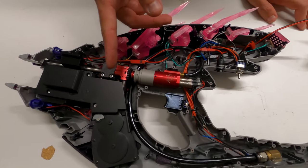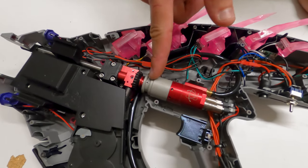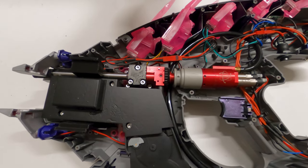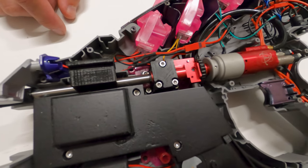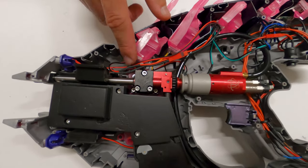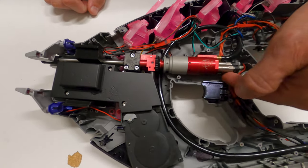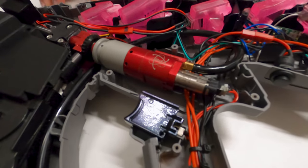For the engine, it's got the F2, and then it uses the bull gear hop up attachment that replaces the front half of the engine, so those two are married together as one unit, which makes mounting it in this gun a whole lot simpler. You'll notice that the only thing actually holding this whole assembly in is this mounting bracket here. It bolts to the frame on the other side and then clamps onto the hop up assembly here. There's actually nothing underneath or around this engine and yet it's still mounted very snugly.